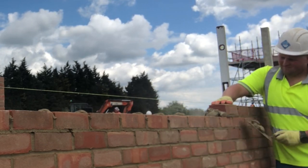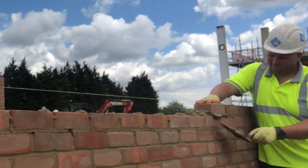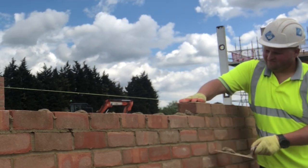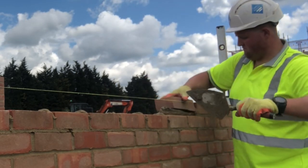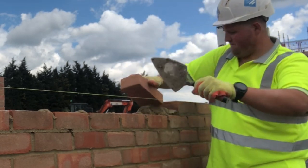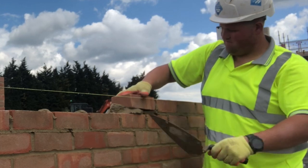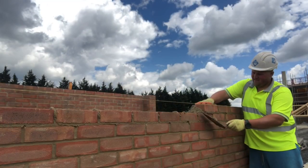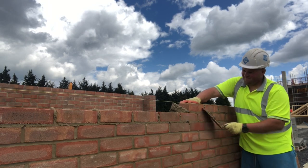Once you've got your gear there, build your corners up and then think about how you're going to attempt running in. Are you going to load out while you've got your gobo? Are you going to use it up building more corners first? Ideally you need to use your gobo up before you go for your snap — you want to go for your snap when you want to get another tub. I normally have one snap. Depending on what work I'm on, I'll get different levels of tub. If I'm on fiddly stuff, I'll get half a tub before snap. If I'm on some straight runs already loaded out, I'll brim it. Then load out while the mortar's coming.